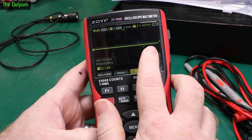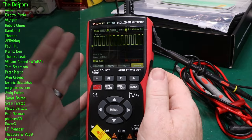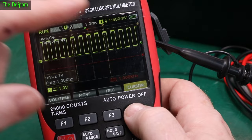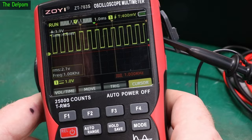The cursor function lets you select which cursor to manipulate. I've got vertical cursors set up. You can move the cursor to the bottom of a waveform and the other cursor across to measure one complete waveform cycle. The cursor controls are clear and functional — you can position both vertical and horizontal cursors independently.